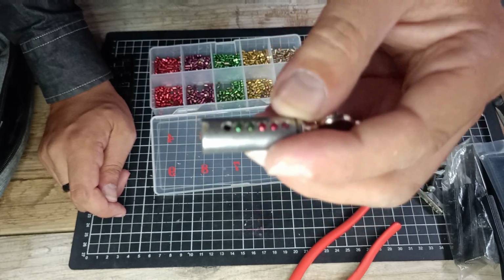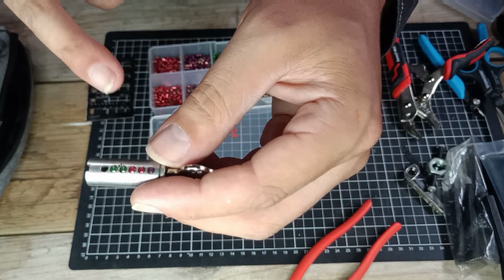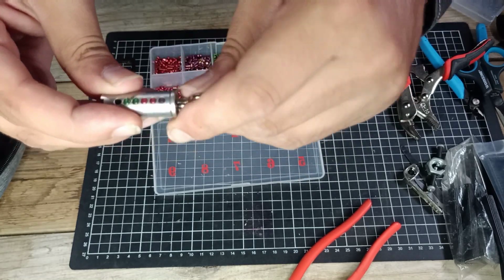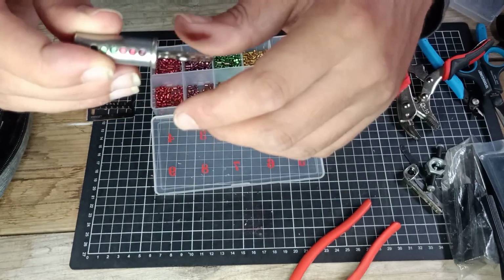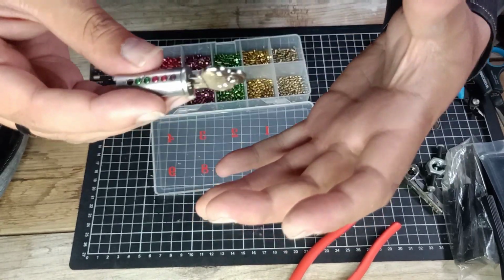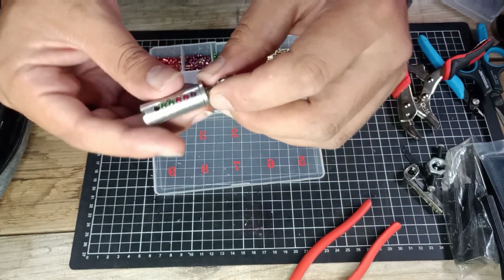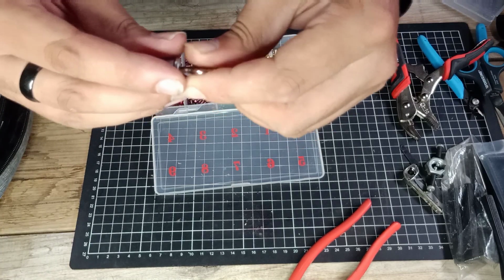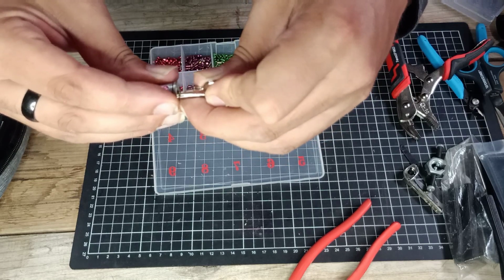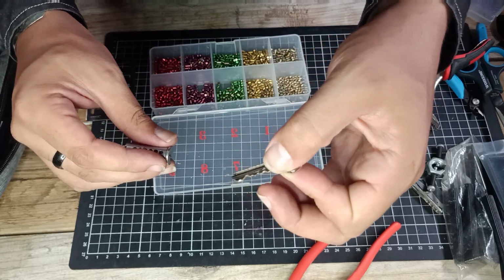I've gone and put them into a lock, the actual lock that I rekeyed. And when I was rekeying them, some of the pins, like two of the pins, were off for some reason. Double checked it in this. It was perfect. It sat nice and flush. It was perfect to actually rekey with. But then in the actual key lock core that I was rekeying, it was off by one or two pins. So the other thing I check, very carefully, is my max must be off with that last cut, because that is quite catchy to come out, which will be that very high cut at the back there.